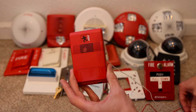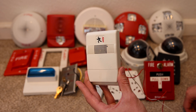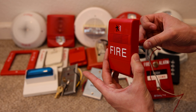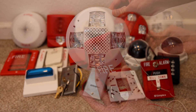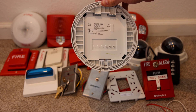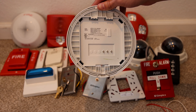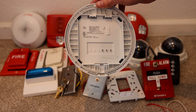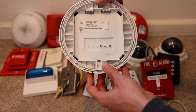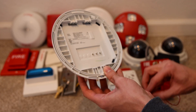These next two devices are really loud. Here's one of the chime strobes. So these ceiling mount alarms do require a mounting bracket, which I do not have. However, the good news is that you can get them for not that much online — they're only a few bucks. I already ordered a couple of them; they're going to be coming in soon so that I can use these in the system tests. But in the meantime, I still can power these devices just by attaching my alligator clips to these prongs right here.